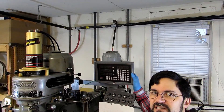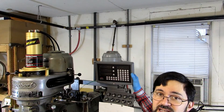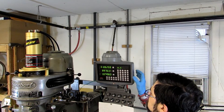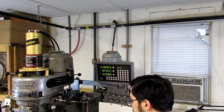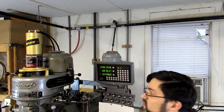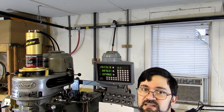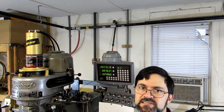I've got the scale plugged in now. Make sure to plug it in when the display is off, otherwise it won't recognize the scale. And let's see if it moves — yes it does. It looks like we've got it installed correctly. That's going to be the end of this video. I'll do all the linear compensation in a later video dedicated specifically to that. Thanks for watching, I'll see you next time.